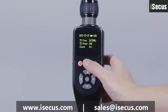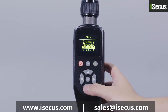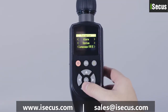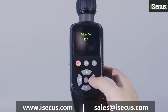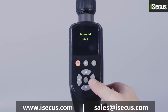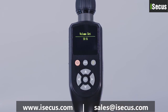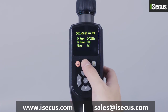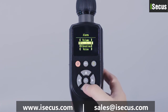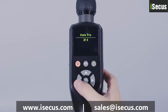Alarm setting refers to adjusting the alarm volume, alarm threshold, vibration mode, and sound mode of the device. The alarm volume can be adjusted through the direction navigation key on the central control interface, where the operator can directly set alarm volume by pressing the left and right keys. The alarm threshold can be manually set for the second harmonic and third harmonic components; when this threshold is reached, an alarm will be given.